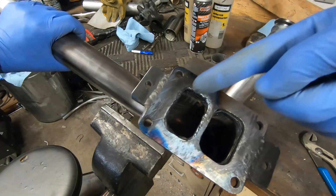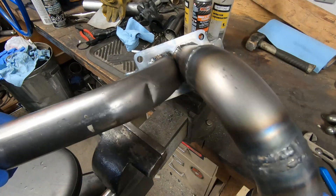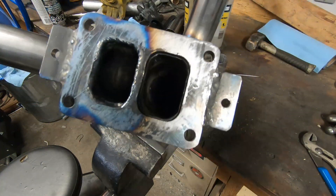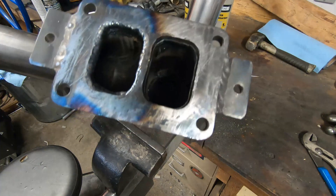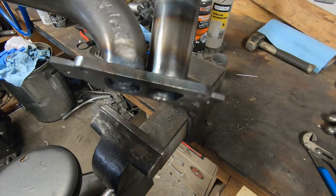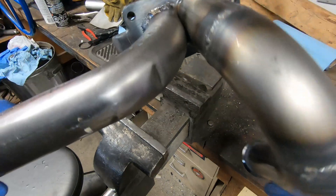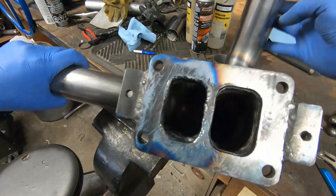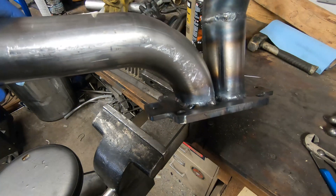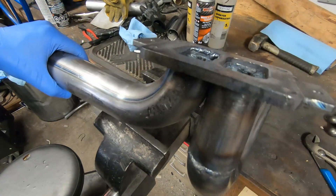The tubing's on the flange. I have it double welded on this tube on both sides, except for in between the two pipes there — this one I just have on the outside. To be honest it wouldn't be that hard to run a bead on the inside, but I don't think there's any point; it's not going to leak any gas, it'll take the pressure just fine, structurally it's strong. So anyway I'm going to leave that other extra weld for now. I did it on this other side mostly because I wanted the inside bead first, and then to put an extra run on the outside was pretty easy and only took a couple minutes. So anyway the flange is done.